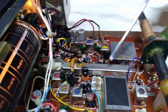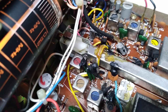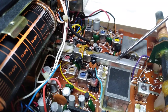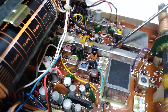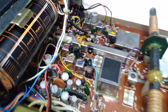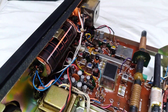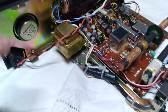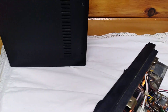This band switch right here is long. When you turn it, it rotates through the different bands. What happens is inside this cage, the contacts get corroded. Now they're self-cleaning contacts, but over time cigarette smoke and dust gets in here and they don't work. When I got this radio off a dishonest eBayer, it was completely dead — the only thing that worked was the lights. It was deader than a mackerel. Nothing worked, and it was because every one of those potentiometers were dirty and the band switch was dirty.